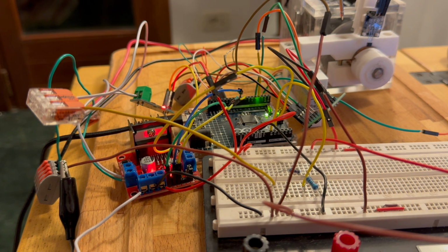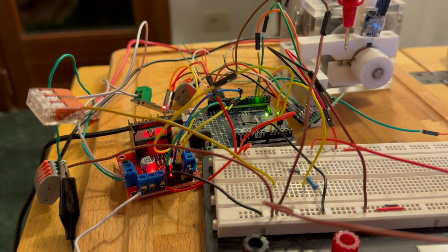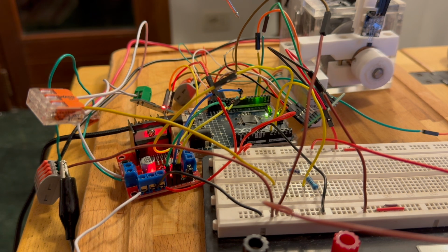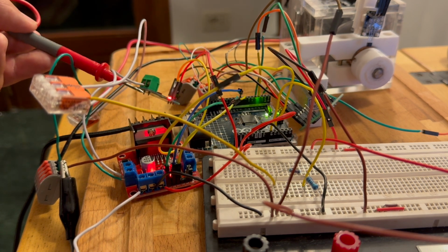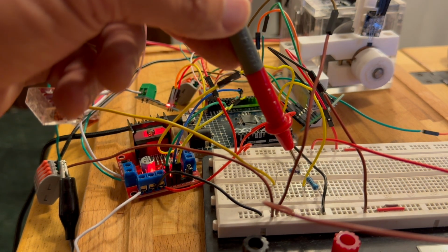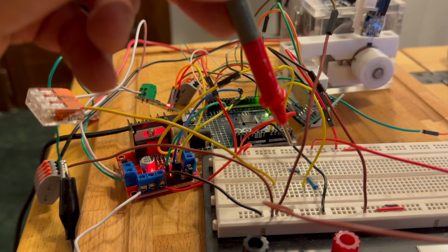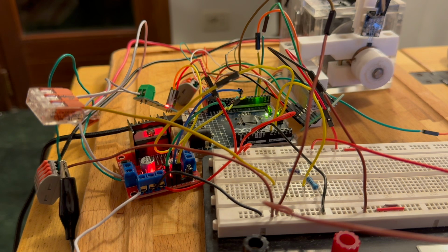And here is the load cell chip, the HX711, which some of you have used in sensor class. And both of you have used the current monitoring chip, ACS712, and I used a voltage divider here to measure voltage. So I have voltage, current, force, which is torque, and then speed.